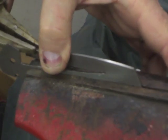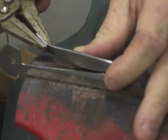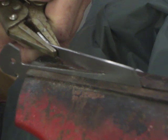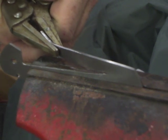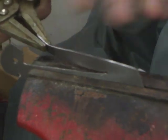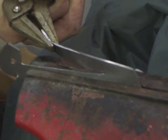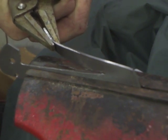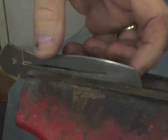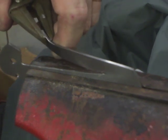And it's springy, but if you overbend it carefully and slowly, making sure again that you keep it even and moving the vice grips down the spring so I don't get it too much at the top, you can keep doing that until you get the amount of the bend that you want in the spring. And I'm trying to bend it about the width of the blade and the two washers, so that it would spring over almost against the other liner if the blade wasn't there.